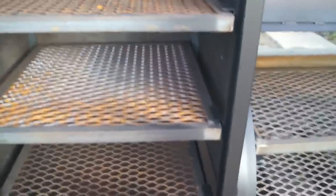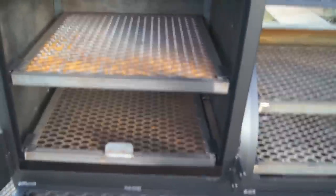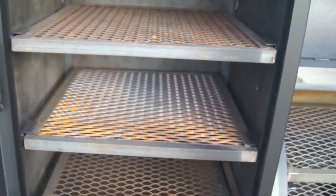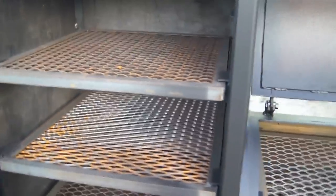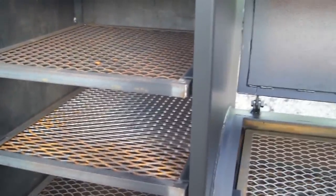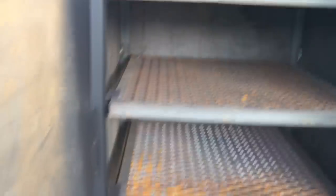Again, this door is flanged, all 4 sides, all the way around. We don't just stick this up there once we flange it. It actually has to be bent in shape to fit the contour of these boxes. They get bent and bowed a little, very slight amount, but it's enough to affect it. And we've got to actually form fit these once we get these flanges on there. Same thing with our main chamber doors.